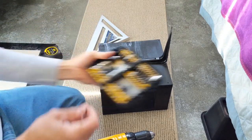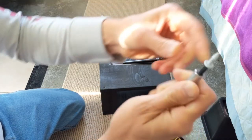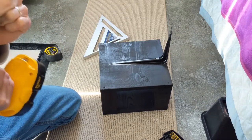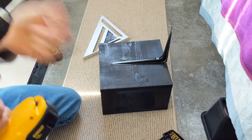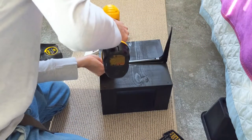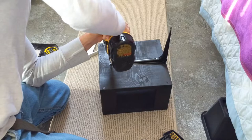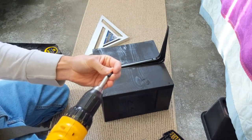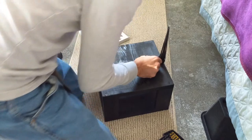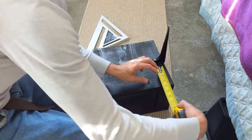I'm not sure where I got all these screws from, but I use these ones all the time. I like the square drive because I haven't had one strip yet as far as I can tell. So I'm going to go ahead and put my screw in here. I don't want it too tight - I want to be able to move it just a little bit so I can make this as close to straight as possible when I do the other side. So I'll do the measurement and make sure it's equidistant on both sides.